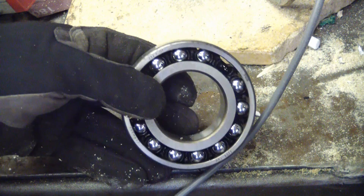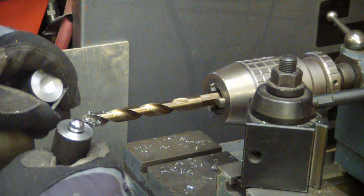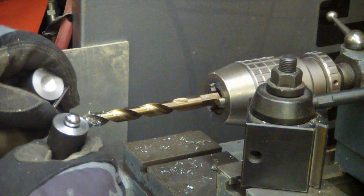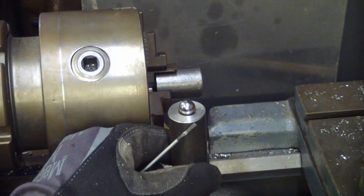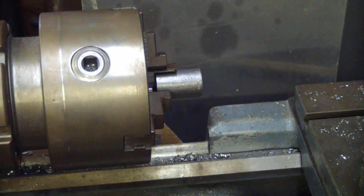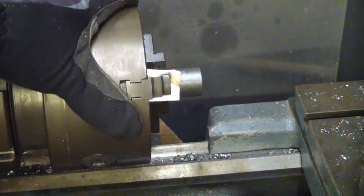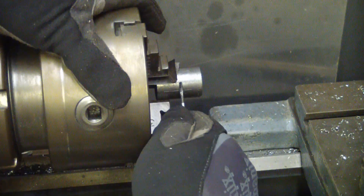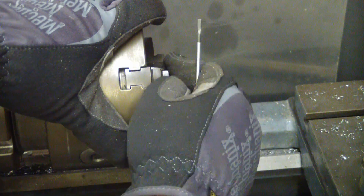There — it's only missing one. Off to eBay she goes. So I got the wobble drive here. I got the wobble head tool holder kind of fleshed out, and instead of using the four jaw independent, I'm using the three jaw in order to machine the offset. I got about 40 thou shim in there.